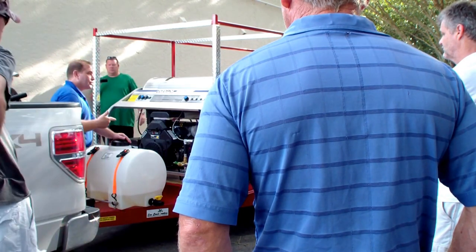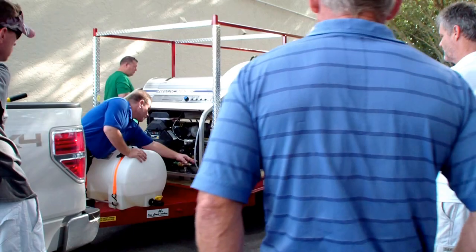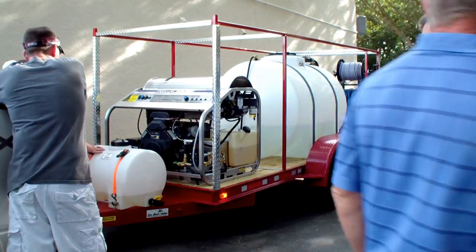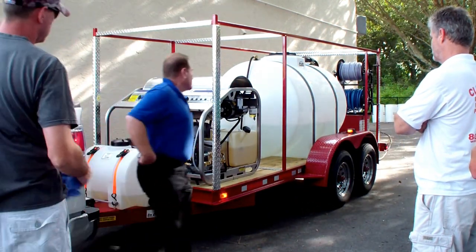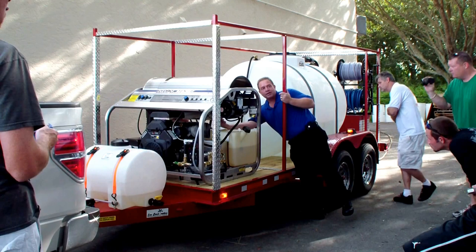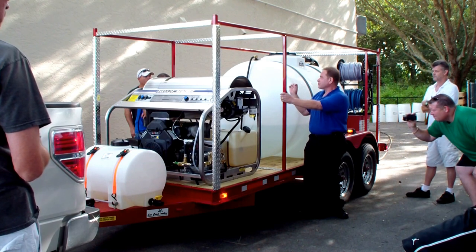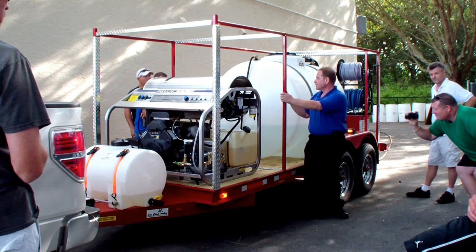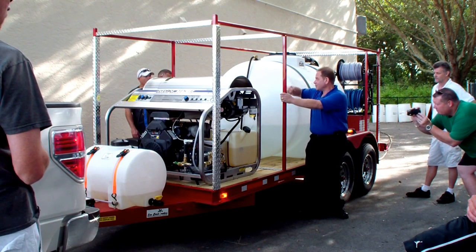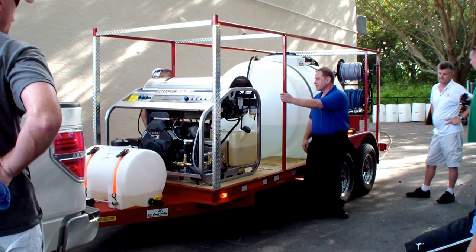There's a pressure relief out here — more redundant safety on the pump side. This is the pressure relief for the pump pressure, set at 4,500 PSI. There's an additional one on the back of the coil. This is your first step maybe before a steam situation. Over a period of time there's an Allen wrench in there for fine adjustment. If it just pops off and your pressure and flow seem okay but your bypass may be a little high, you may be able to adjust it — it might just need a half a turn after a year of lost spring tension.